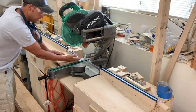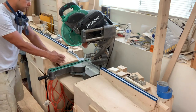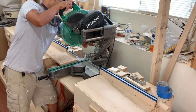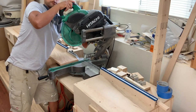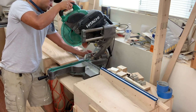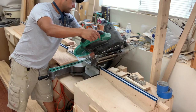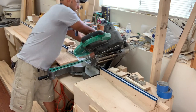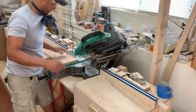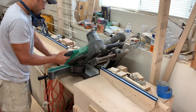At this point I've cut it square to a couple of inches longer than I need. Now I need to make a 45 cut on the end and then cut it to length and do a 45 return on the other end. Like I said, you can't stand it up. If you have a dual bevel saw — or even a single bevel saw — you can bevel it one way and then flip the board over. On this particular saw you loosen the back, pull this piece out, dump it to 45, then lock it in place by tightening the back.